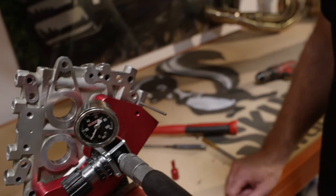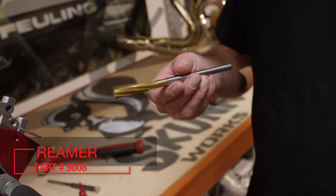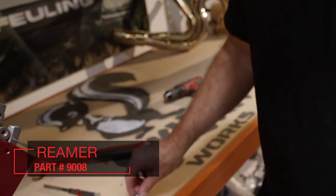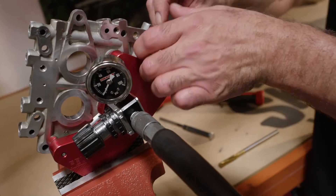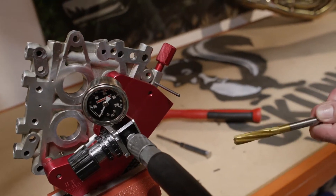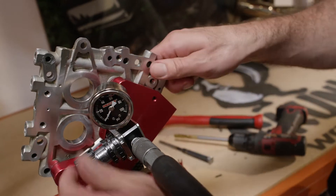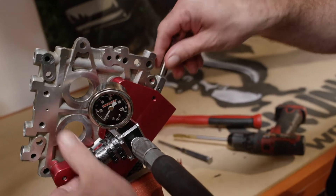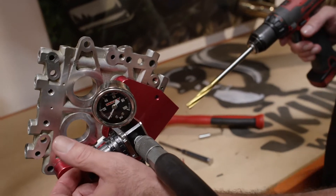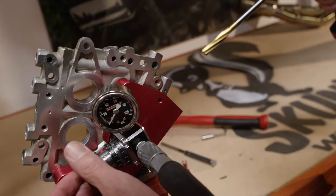The next step involves another tool we sell: a reamer. We go down into the bore, square off the shelf at the bottom, and then repeat the process. Hook the reamer up into a standard drill. Use the air pressure to blow the plunger back out. Make sure you've got the air on, which will help blow the shavings out of the cam plate while you're using the reamer.